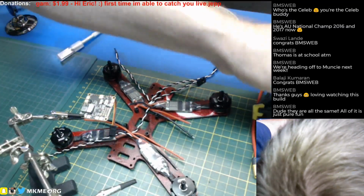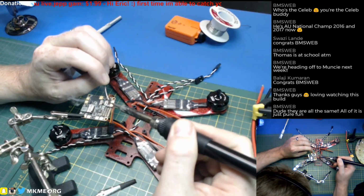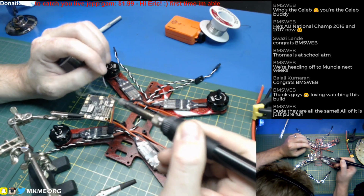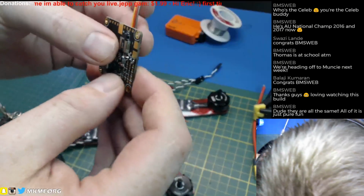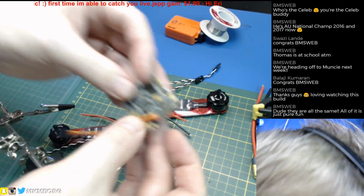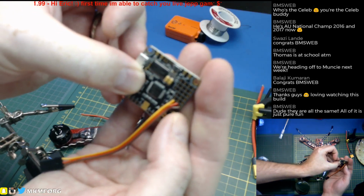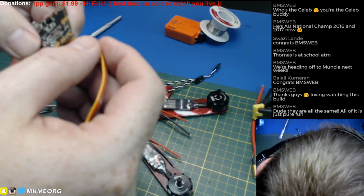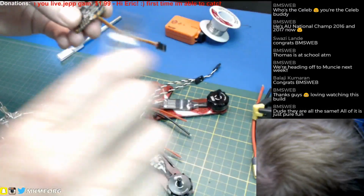That's alright. Let's just get a little bit more flux from a bigger chunk of solder. Call the big boy in here. This is just a different brand of solder that seems to be a little better when you've got stubborn stuff. Alright. Now, did we do it correctly? That's the top side, so wires terminate right at the PCB, no extra, nothing hanging out. And did we do it right? Signal, S-bus, 5 volt, then ground. Perfect. I'll go ahead and trim these off.